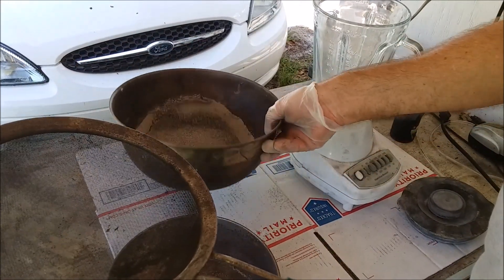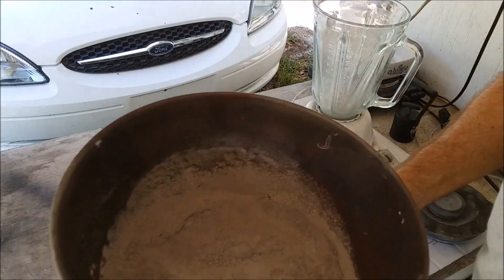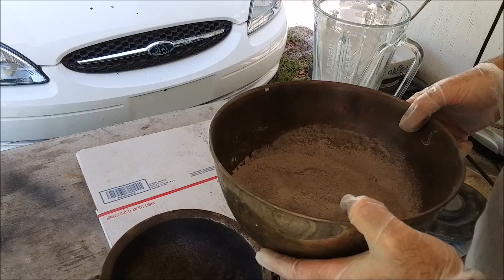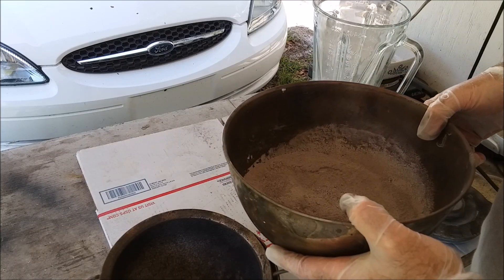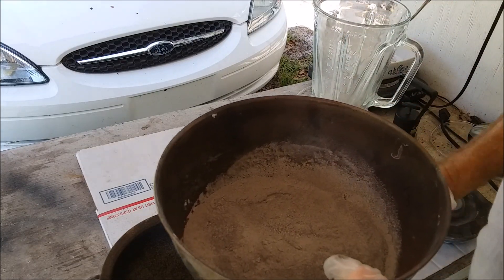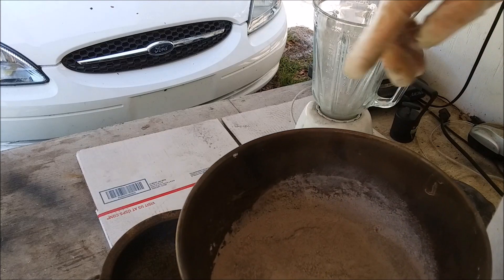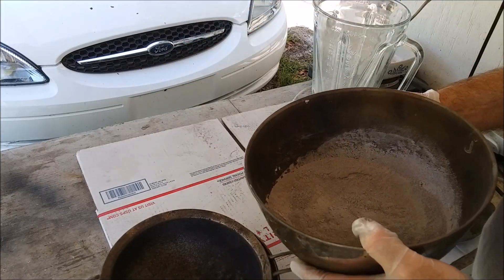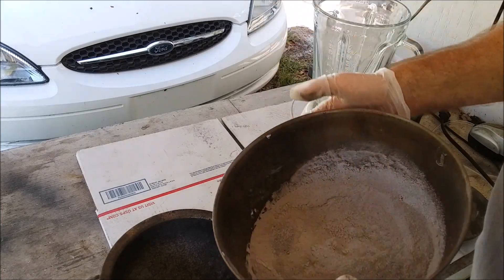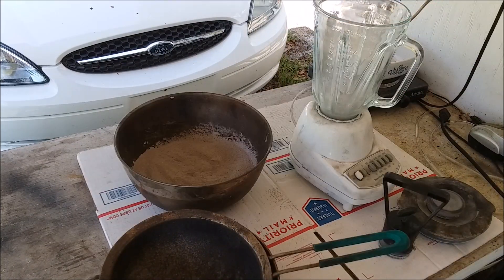That's how I get to this stage — I've got a nice fluffy white ashy powder that goes through this kitchen sieve. The next stage is getting rid of most of the ash, and for that I'm going to use a quick gravity separation. I'll set up and film that in a day or two. Basically, I'm going to put this in a bucket and spray it with my garden hose to agitate it. Let it settle for a second or two so all the metal and silicon die gravel falls to the bottom, then dump off the water into a pan to catch anything. Keep agitating, stirring with the water stream, let it settle, dump it off — and keep doing that until the water coming out is clear and I've washed away all of this fine ashy stuff. Thanks for watching — keep it safe out there.